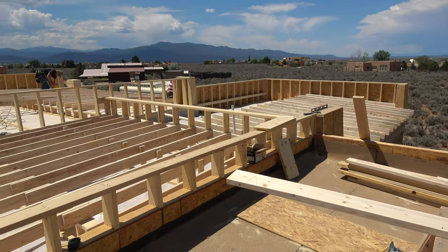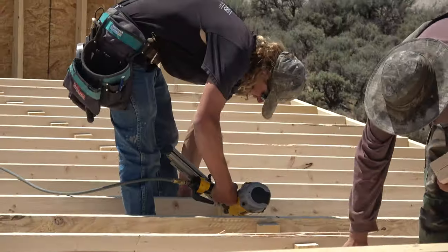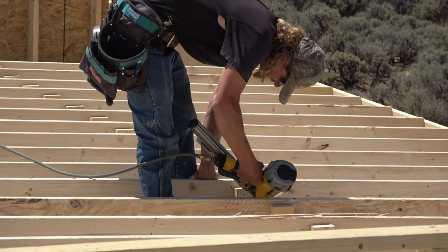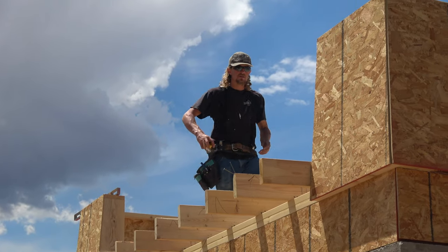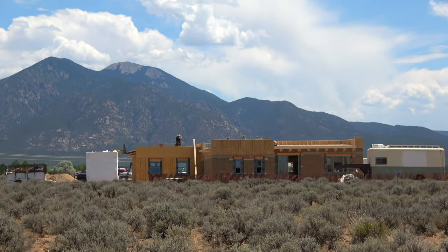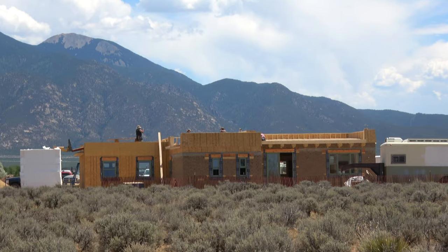The next step is to build a roof. We frame it in two by six material with a pitch of a half inch to a foot. The wiring is all put down underneath, above the deck and below the roof, and then it is blown full of fiberglass insulation before roofing.